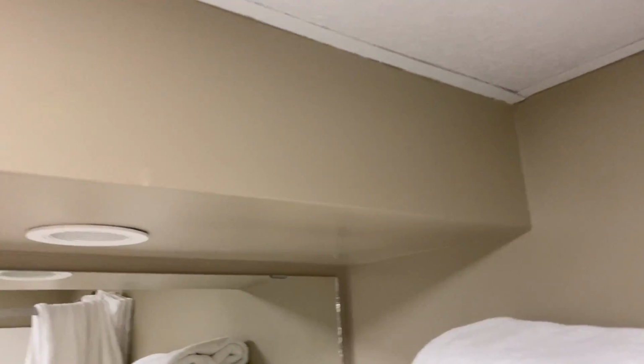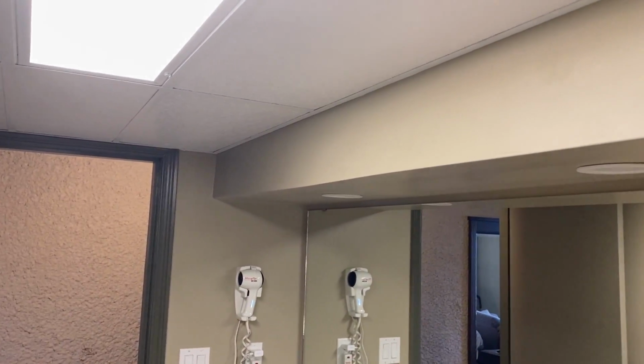Okay, and as we look at this corner bead, I can tell by the radius that it is a vinyl corner bead, and there is a joint right here. So somebody did a repair on this. It's not uncommon to see bulkheads get repaired. Maybe there was a leak. It is under 10 feet long though, so you didn't have to put a joint there.